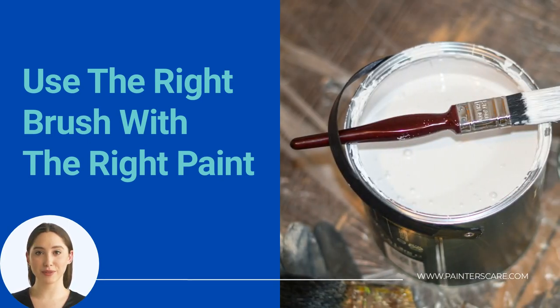As a general rule of thumb, not all brushes are intended to be used with all paints. Enamel paint brushes are a great example — celebrated for their synthetic bristles that allow for plenty of wear and tear, but you should only use them with enamel paint. Natural bristles are a great choice for acrylic paint because they hold up well against its thick, viscous consistency. The classic choice for oil paint is hog bristle brushes, due to their stiff nature and ability to produce precise brushstrokes despite the paint's globular nature. Stiffer bristles are also ideal because oil paint brushes need to be cleaned vigorously. For water-based or latex paints, a synthetic brush is recommended as it holds its shape well with the paint's smooth, gooey consistency. Latex paints are heavy, so they need a brush that can withstand them.